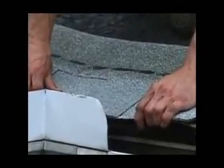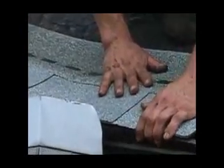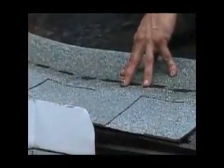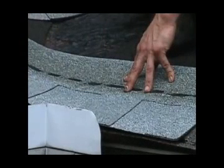Bring the first course of shingles along the eave and across the valley onto the roof plane that has the lower slope or lesser height. Starting on this side allows the largest volume of water to come over the cut and not into the cut. The first course is the only course that is woven with the intersecting roof surfaces.